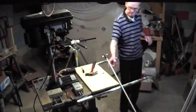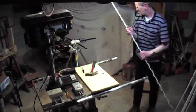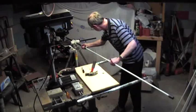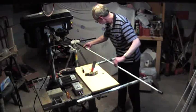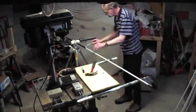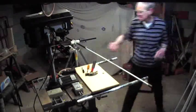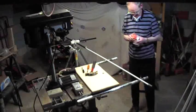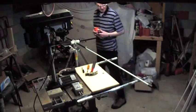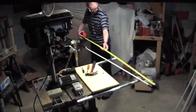Now you take one of your rods — let's find out how this works. Take one of the rods and slip it in. I set this up beforehand so I could do this little demonstration, and as you can see it goes in and off very neatly. We use a hose clamp to tighten up when we've got it where we want it. So we take this measurement tool here — it can be a little awkward sometimes. We're going to measure off 75 inches to the tip.